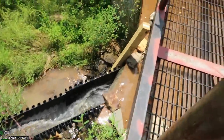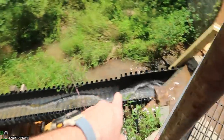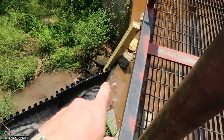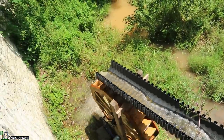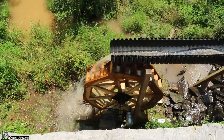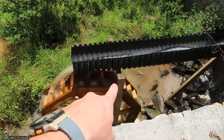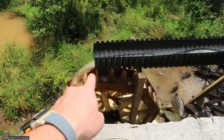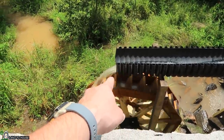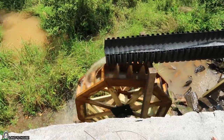Let's get a closer look at what's going on here. He's simply put a little board across the water to capture everything and move it over to this little trough, which is just a piece of pipe — maybe 12 or 14 inch pipe that he cut in half — with a slight slope downward so the water pours off the end. You can see how inefficient it is; he's only capturing a very short contact time with this water. If he were to drop it down another six inches and maybe chop off two or three of those ribs to let it sit closer to the top, it would have more time with the water. I'm definitely not a professional when it comes to water wheels, but it seems like there are a few inefficiencies going on.